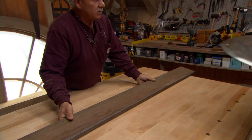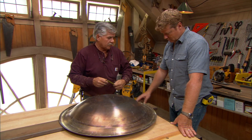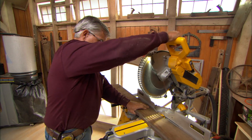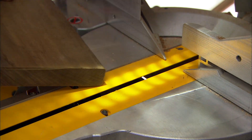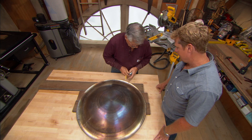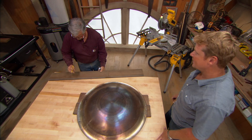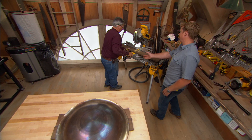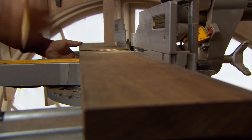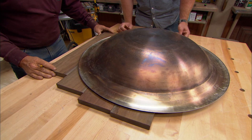Here's an eight-foot piece of decking. Take that piece, flip it over, and lay it on top of the boards. We want to have a one-inch overhang all around the perimeter when we're finished, plus a little extra while we make it. I'm going to measure right here — about an inch and a half on each side, put a mark, and that will cut. The two boards in the middle are pretty close to the same dimension, but as we get further away, I mark my inch and a half here and down here where I'm going to cut it, take that board, and I'll probably be able to use this one out here. Slide this one under there — look at that, perfect. Two more pieces.